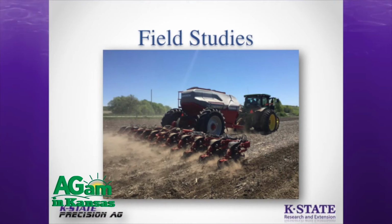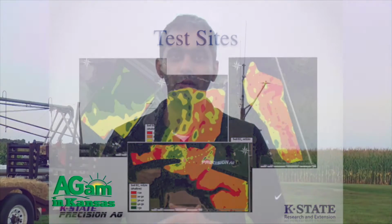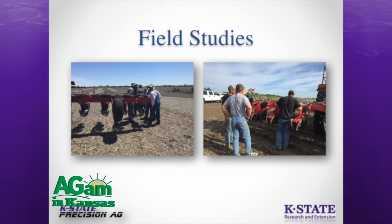So we did a small study over the winter. We did a high-speed imaging project where we were planting corn at different speeds. We were planting corn at different populations, and we collected almost 1.8 million images and built up a data analysis or image analysis program to look at accuracy. And what we learned is that you can go up to 7.5, 8 miles per hour, and you should still be within 96.5, 97% singulation, which was pretty good.